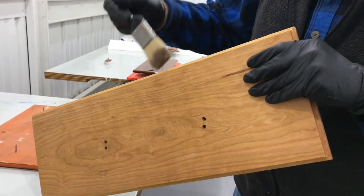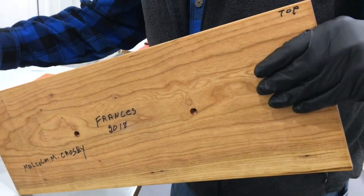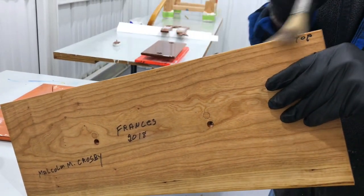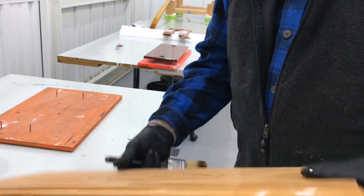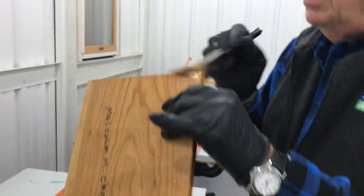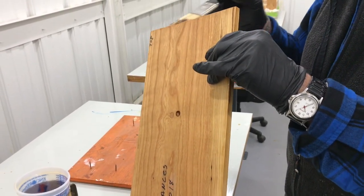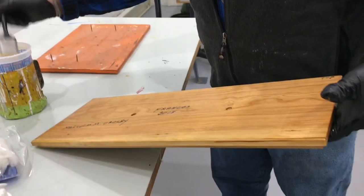One thing we like about the Epiphanes is that, though it's probably a lot more expensive than what you'd find at a hardware store, it fills the grain better if that's important. Some of the plaques I did, I just used tung oil that you can get at any hardware store — rubbed on three or four, five coats. Very simple. It comes in either gloss or satin and it's a lot easier. It doesn't fill the grain like varnish does, but it looks fine.